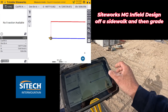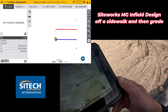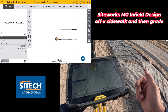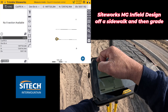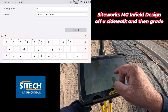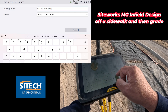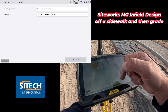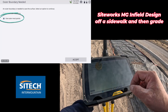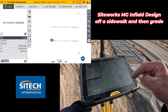I just needed to come down to about this area right here to grade this out — it's really simple. Once you've done that, just hit your menu and measure to cancel that out. I got two lines right there. I'm going to hit menu, go to data management, surfaces, design, and call this the 'Sidewalk Offset Model.' I always include the line work; hit accept. Since it's the only thing on my work order, I don't need to do an outer boundary — I'll do outermost points — and it shoots.